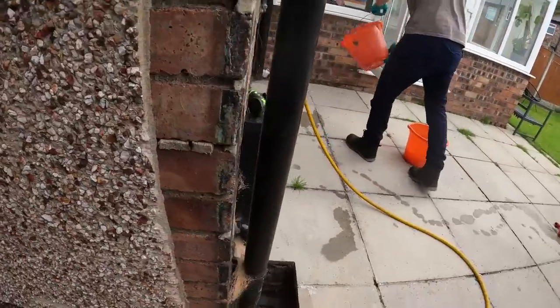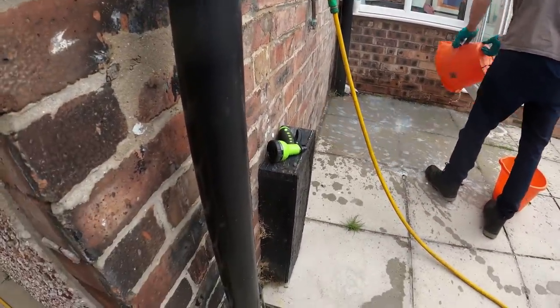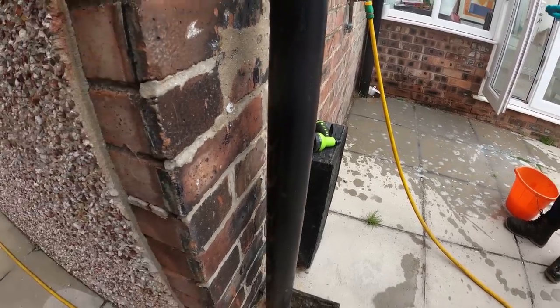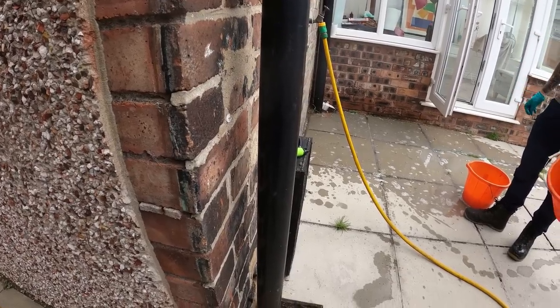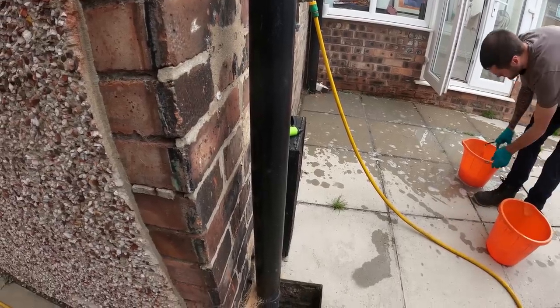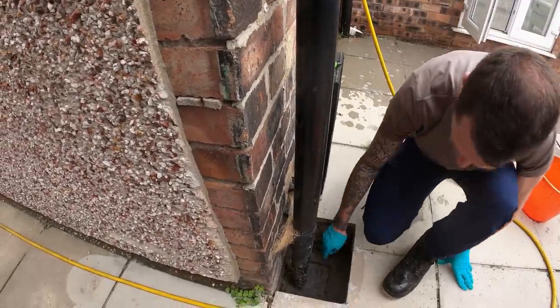Let's do this pulley. Well, for now, yeah, it went easy enough, so the blockage was on the very end there, you see. You can see, if you've got waste coming up from the bottom of that rest bend, it could only be just on the join, couldn't it, on the rest bend itself. So it's up to yourself how you want to go about doing it, because you can either just dig out the rest bend, so you dig it up anyway, lift that flag up.